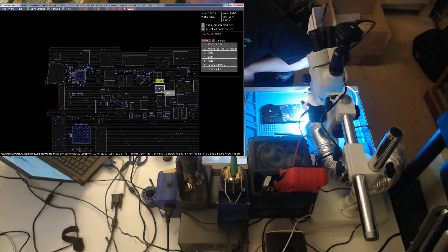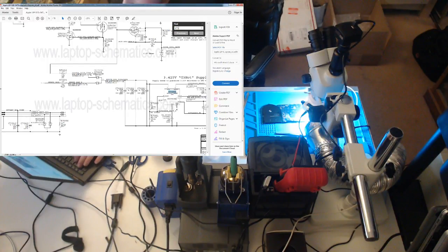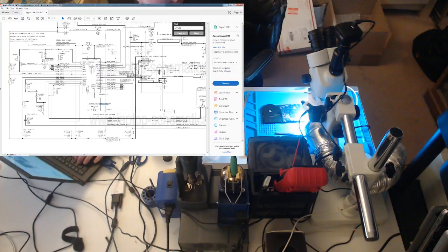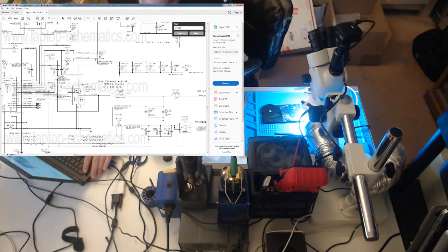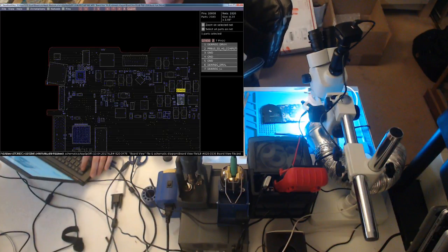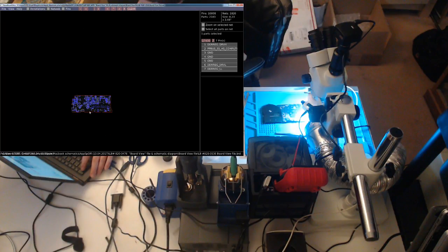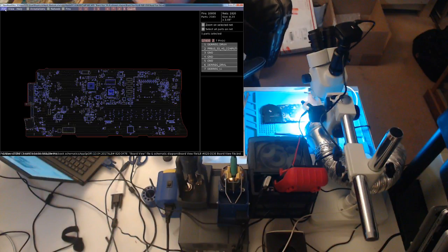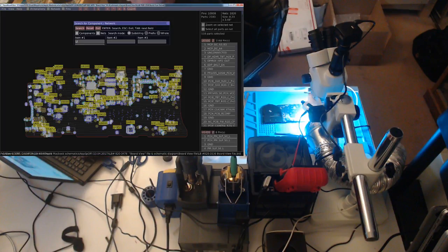They're around here somewhere. Look at the schematic, but since we had low voltage, Q7130 probably got messed up. And then we put a new ISL on, and Q7130 messed up the new ISL, and it gets to be this cycle. I've had that happen before, or vice versa. Q7130 might have been bad and messed up the ISL. And we get stuck in the cycle of replacing the ISL and having it get messed up again. I've had that happen a couple times. I'm hoping that's not the issue.